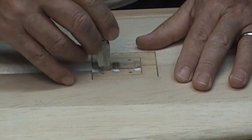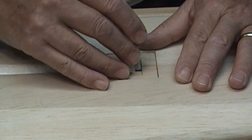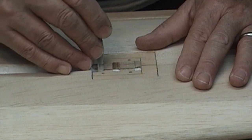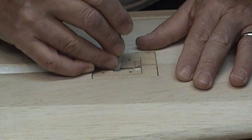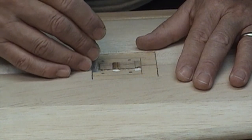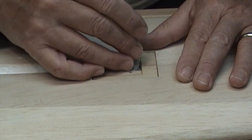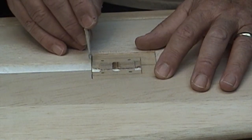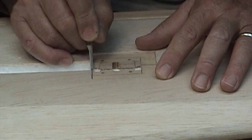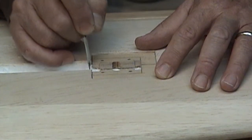Now the sides - you could really use the width of the landing gear block cutout to do this and it will come out okay. If you go a little deeper it's not a big deal. One more time, make sure I'm at the correct depth. Then across the front - this is kind of an eyeball thing. See where the front of the block is, go straight down from there, and go straight to the other side. If you go a little deeper than you want to, that's okay, as long as you don't go out the top of the wing.